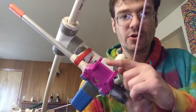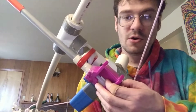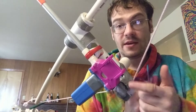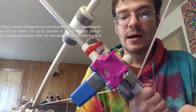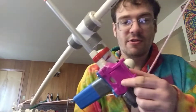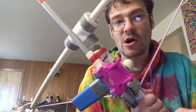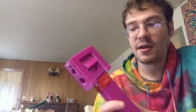This version 6 Canetana uses small nubs on the dart door and small nubs on the body to limit the travel of the dart door, so I can only push it so far in either direction, and it's not really far enough for the magazine to spray all of its darts out. The big difference between this and later versions — which I do recommend more on my Thingiverse — Canetana versions 7 and 8 — is that these little nubs of plastic are subject to delamination. The short story is, this is not a very robust way of limiting dart door travel, and there's a very strong risk that one of these plastic knobs is just going to break off with no good way to fix that. The 7th Canetana is dramatically more robust and harder to break than the 6th version.